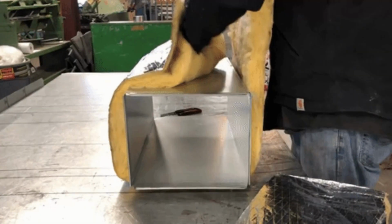We do use it as a liner sometimes for lining return air chambers, and then we'll seal it. But other than that, we don't use it. Now, we use sheet metal plenums. So the question is whether you line it, or use a fiberglass insulation on the inner part of it, or you just wrap it on the exterior. I prefer to wrap the exterior.